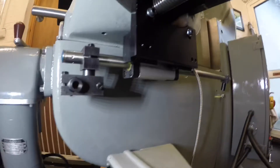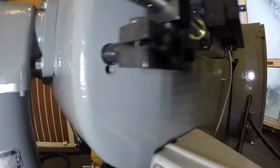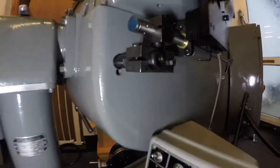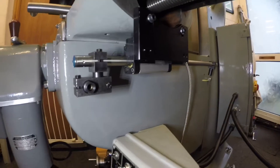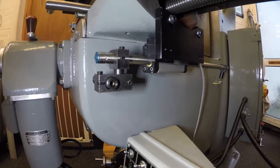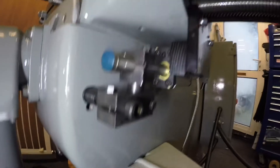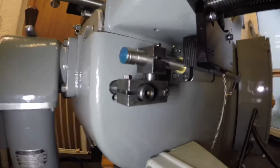I've got the scale bar rested inside the reader head and I've put this side in. I already had a drilled and tapped hole just underneath there because this mill came with one scale on the Y - someone had a kit in the past that was taken off, damaged, or not used. It didn't come with the digital readout display or the brackets - just had the one bar attached. I couldn't quite use that hole, so I've just done another one. It doesn't really matter. That one's loosely fitted.